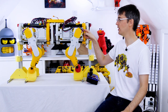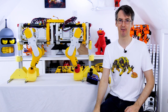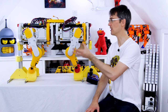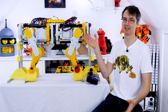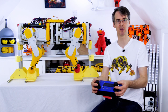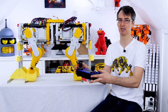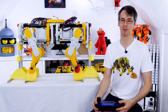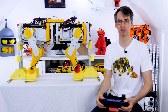There is quite a lot of load on those pulleys holding the knee, and the same on all the others, so we'll see how long those pulleys with a hole in the middle for the bearing last. Ideally I'd have some made of metal, but there are a number of other things I want to redesign — including a higher belt reduction, bigger motors, and lots of other stuff — so at some point there'll be an OpenDog 2.5. For now I'm just driving it by radio control with my everything remote: six axes and some switches for motor enable and menu bits. Eventually we're going to make a ROS-controlled robot, but for now I want to get a Jetson Nano on here so we've actually got a computer with an operating system and can try more intelligent control.